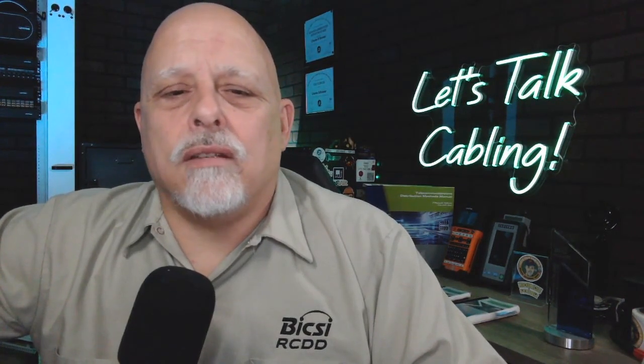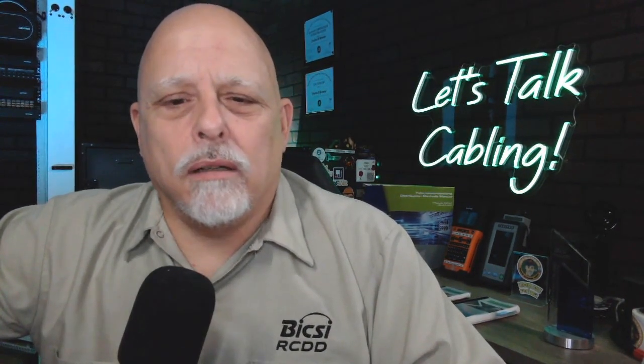How does that loss affect the optical network? On our splicer, for splicing single mode as well as multimode, it is going to be an average of 0.02 dB loss. So it's very, very low. In terms of the machines and the software today, they're a lot better than they were when I first started in this industry.